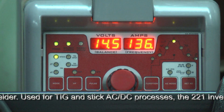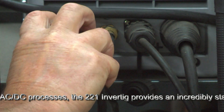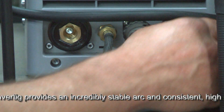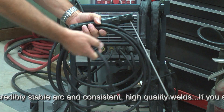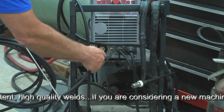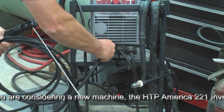We're now in arc welding mode. Since we're no longer TIG welding, we'll simply disconnect the TIG function, and this gives us access to the negative polarity jack — you can see the minus here, with this side being positive. Here's the electrode holder with a stick rod in it and the cable that goes into either negative or positive polarity plugs. Let's go ahead and plug it into the negative plug socket, the same one that was used just a moment ago for TIG.